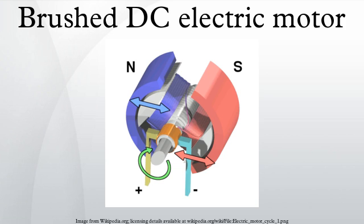Fuses and circuit breakers are overcurrent or short circuit protectors. Ground fault relays also provide overcurrent protection. They monitor the electrical current between the motor's windings and earth system ground. In motor generators, reverse current relays prevent the battery from discharging and motorizing the generator.